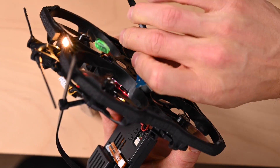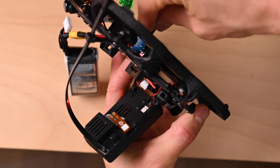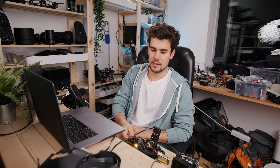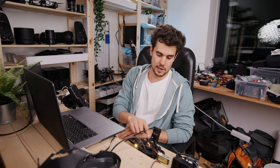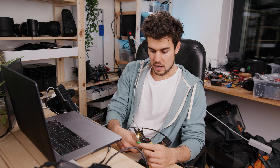We still have to activate the air unit first. Download the DJI Assistant for the FPV edition — I'll link it in the description. Take a USB-C cable with a 90-degree adapter and plug it into the USB-C port of the air unit. The air unit appears in the app — click on it and press Activation. It will walk you through the steps and also upgrade your air unit. It can take up to 10 minutes, so just leave it — it will get really hot but should be fine.